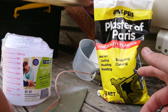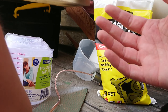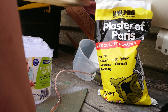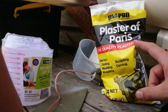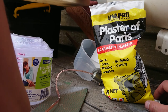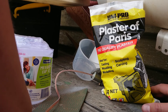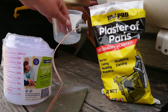My current casting process involves taking an object or making molds directly on the laser and casting directly into them, but MDF just isn't up to the task at 1,100 degrees. So I'm going to try plaster. One idea is to cast small sheets of plaster and laser engrave them to make molds. The other is to laser engrave wax, make wax masters, coat them in plaster, and do lost wax casting. This is about experimentation and finding what works.